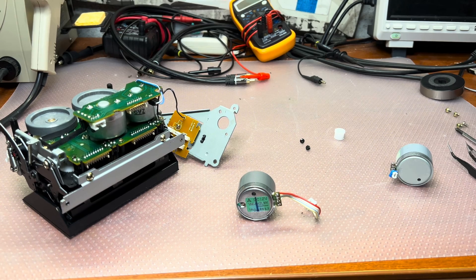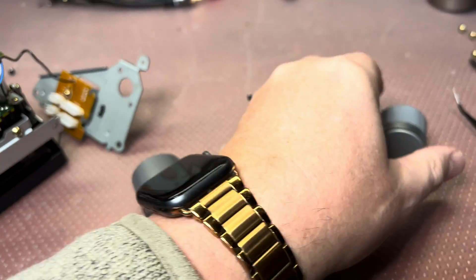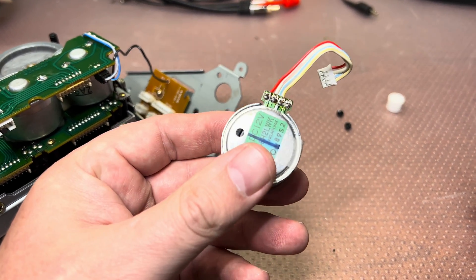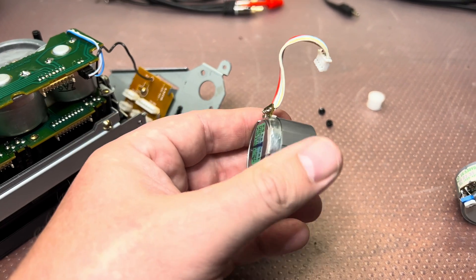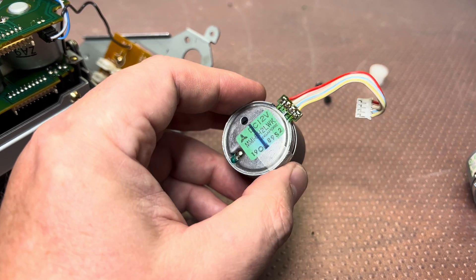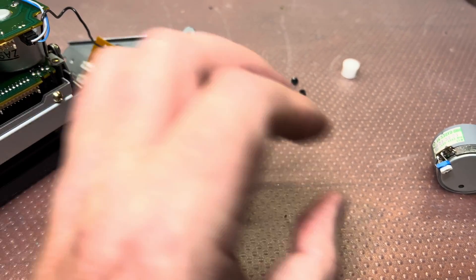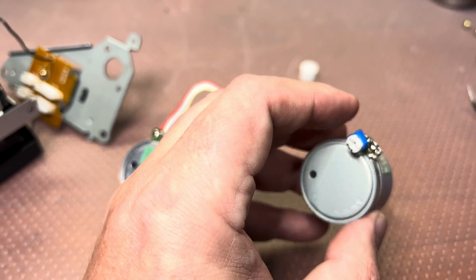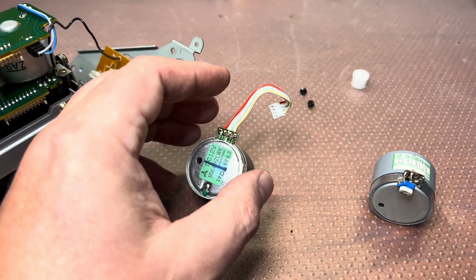This is the fourth time I'm disassembling. I installed the new motor and it was running too fast. I put the old one back and the old one works — I can adjust the speed but it's still too high, and over time it's getting hot. I believe the microchip is shot. I was looking at the schematics trying to understand the reasons, and I'm installing a pot right here to adjust the speed, and it adjusts pretty well. I measured voltages and this matches the Sony deck.